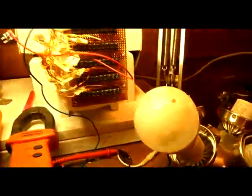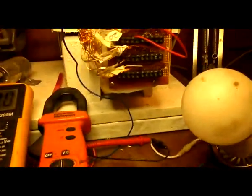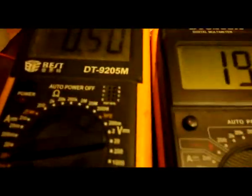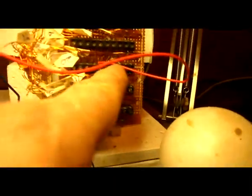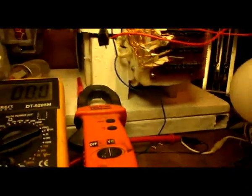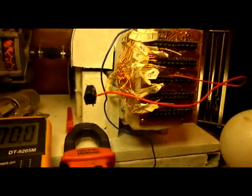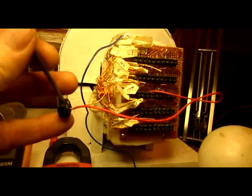Now what else I wanted to show you was I took these 50 terminals here and split them up. Now watch what happens to the amp draw. And all I'm doing, I'm not powering anything. All I'm doing is unhooking the center wire. This red wire is lugged. I put a lug nut to the wire that goes there. So I'm, in essence, breaking up the board into two separate circuits. Now watch what happens when I take that lug off there. Listen to the sound.